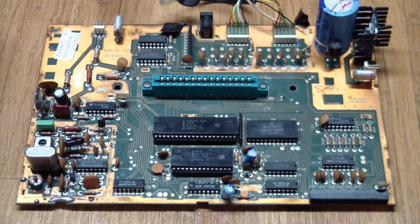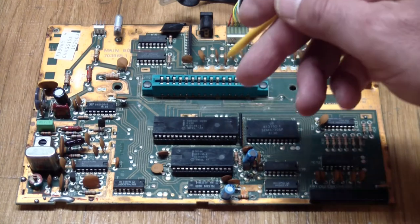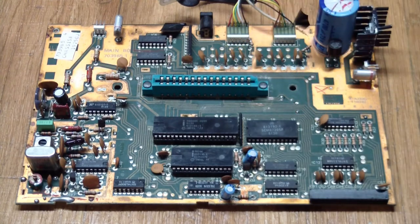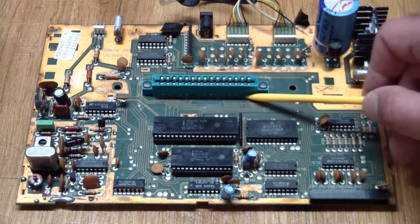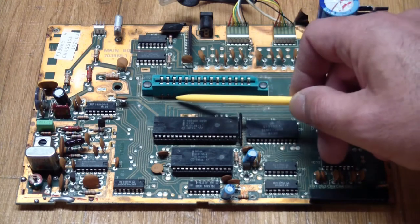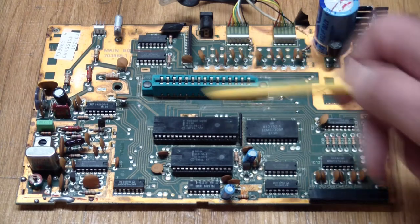That's very interesting — let's investigate further. Long story short: the pins that were disconnected had traces connecting them to the board, but part of those traces were underneath the actual connector. It seemed the disconnect in the trace was happening underneath the connector. This is a high-stress part — you push the cartridge in and pull it out all the time. My guess was that inserting and removing cartridges may have damaged the traces underneath the PCB, resulting in no continuity.